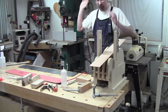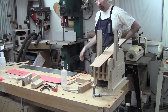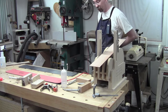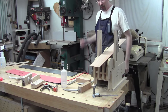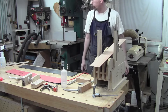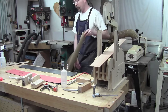I'm going to go with what a guy called Blues Creek Guitars does - he has bending machine videos that are really really good. He's around the 220 to 250 degrees Fahrenheit range. I'm going to kind of start in that realm. I have a feeling I'm going to want to go a bit hotter than that - he was in the 300s in one of the videos. We're going to see if I can't screw up a piece of cherry.